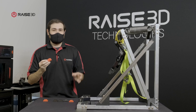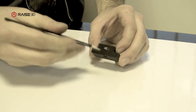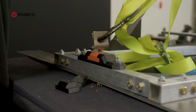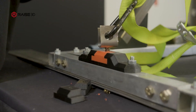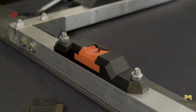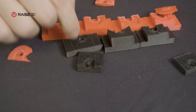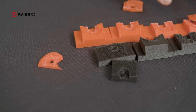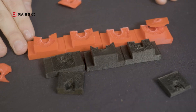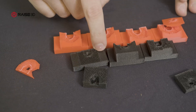The next design uses the same nut approach for threading but with slots in the back, so when the part finishes printing there's no pause point — I can slide the nuts in afterwards and thread through them. Most of these broke similarly to the embedded nuts, popping off the initial cap. However, the strength differences were significant: PLA ones got to around 67 pounds, while the carbon fiber nylon ones with the slots got up to around 80 pounds before breaking.